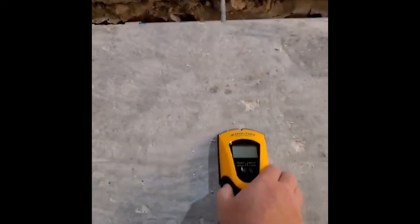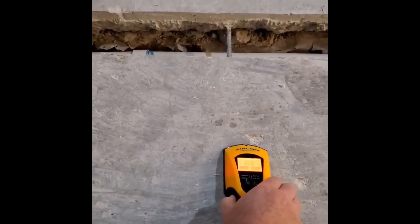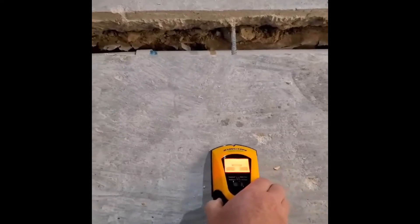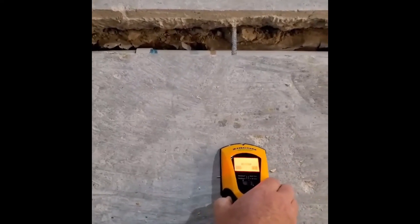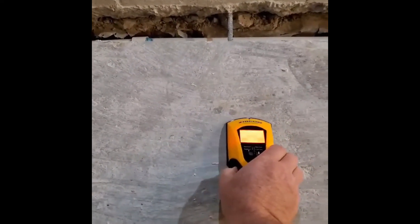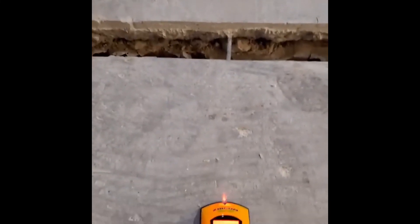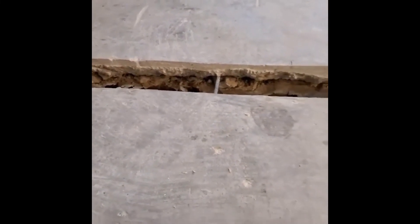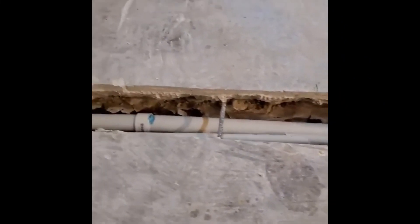Let's go over here and see the lines. So it's not precise, but it gets you very close. It helps not to have any kind of trash where the finder can sit flat, but anyway that's an easy little trick we use to help locate cables for post-tension and any kind of rebar.